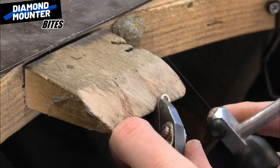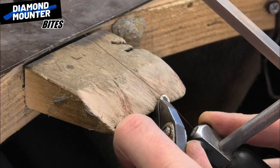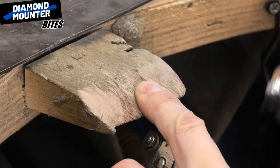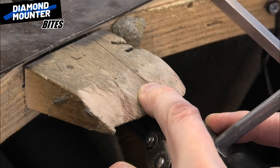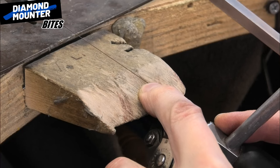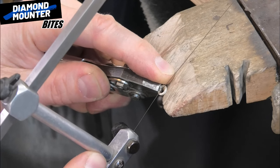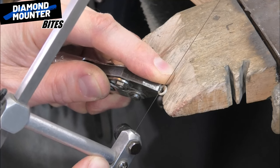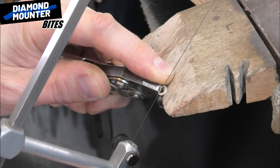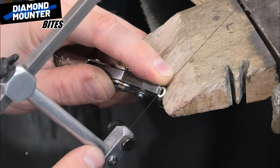With that little nick, I'll be checking it on my line, and if I like it, I'll put my saw blade back in that nick, rocking it up, checking the semicircles either side of my saw frame, putting it back on the line, and cut. I'll demonstrate on this side — touching it over the top one, putting my blade down the middle, checking my semicircles again, the blade supported by my finger. Just carefully put a little nick in there. That's why I like a fresh, sharp saw blade — you can put a mark in the metal with less effort.